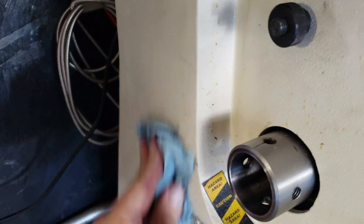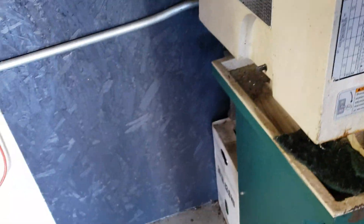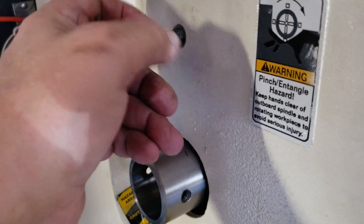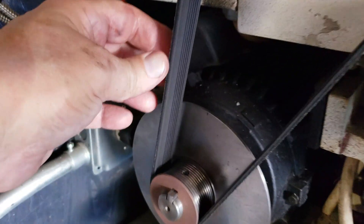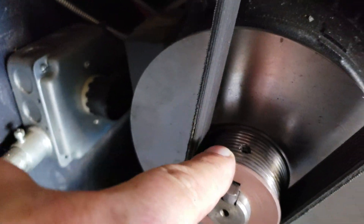I'm just cleaning the top of this off — I've got oil and stuff all over it. So what I did is I built new serpentine, or micro — I think they call it micro V-pulley. So it now takes one of these belts; it's just a single belt. I built this pulley and I built this one.